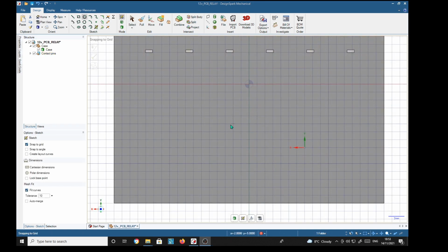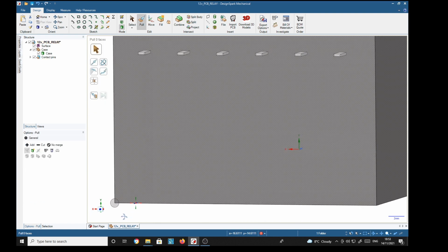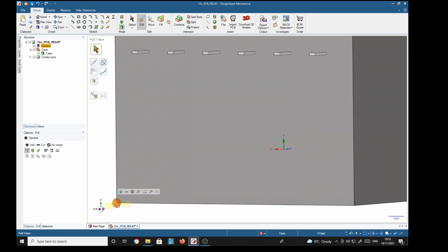Now that we've got the contact pins in, I'm going to put the solenoid pins in. Now these are just circular pins, so we'll put one on the corner here, which is my reference point. These are going to be 1.1 millimeters. And P for pull. Select it. It is going to be 3 millimeters long also,